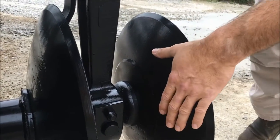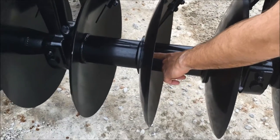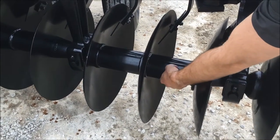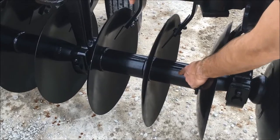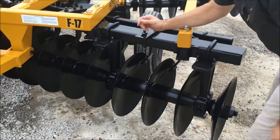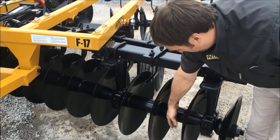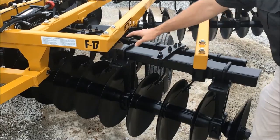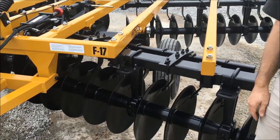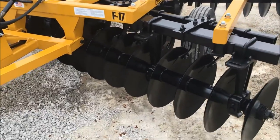It just performs so much better with it. We have steel spacer spools — these are welded. I have seen these in the field working with huge dents in them. You are not going to be able to do that with cast spacer spools. If you get out there and hit a cast spacer spool like that, it breaks and causes everything to have slack in it and you have to go back in and replace it. The welded spacer spools are so much stronger.